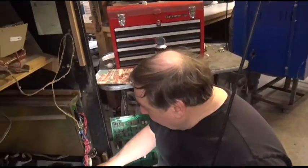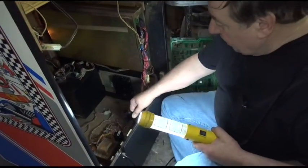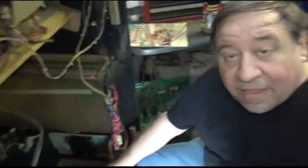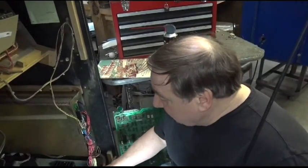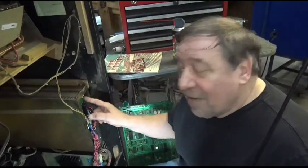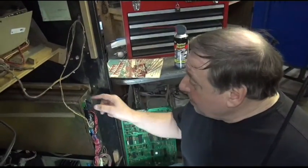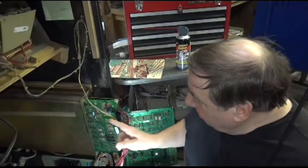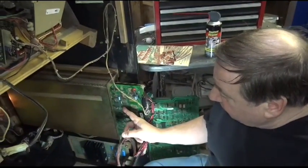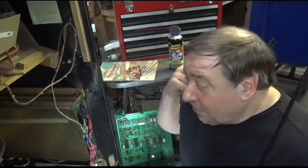Batteries like that. Anyway, Bob Roberts supplied the cap kits. He sells the complete kits to rebuild the Atari power supplies. You have to rebuild these because they not only have the amplifiers on them, but they also have something called a sense circuit. Very clever design of Atari. With the sense circuit, when you have it adjusted at 5 volts here, it's 5 volts on the board. Without the sense circuit, with all the standard power supplies, you actually have to adjust it right on the board itself. You have to measure the voltage right off a chip. You don't have to do that with this. Very, very clever. And we're talking clever, and that was years ago.